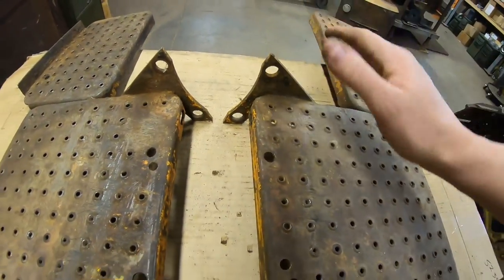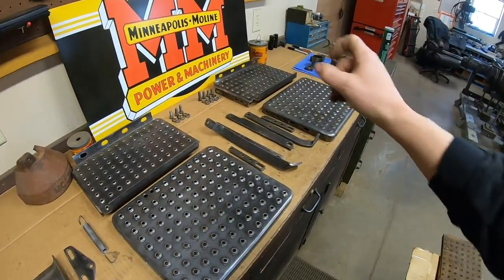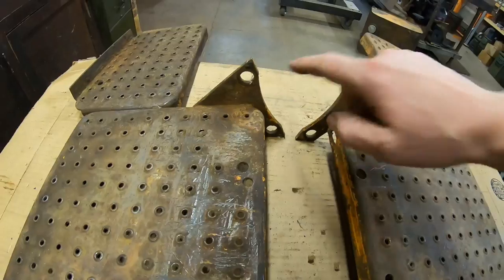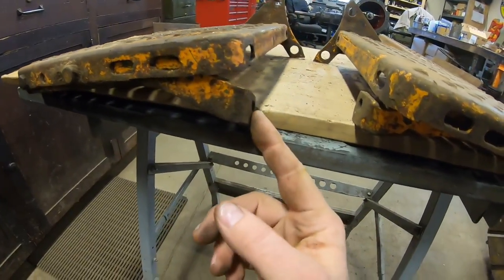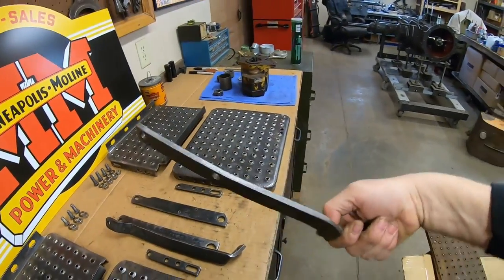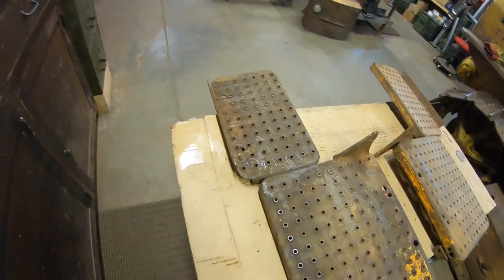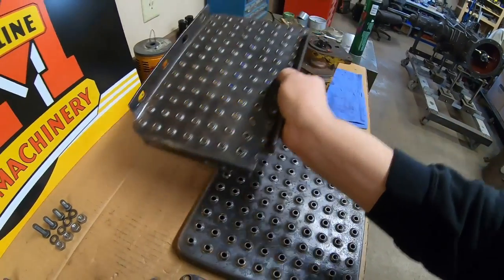Mounting brackets on the production foot plates were also streamlined quite a bit from the rather erector set diagonal brace and spacer plate and everything else arrangement on the prototypes. The two back corners just used that piece and that piece that went under four of the transmission case flange bolts. And then we had this straight across bracket at the front with the tight angle bend short drop on both sides that mimics what just the right side front bracket was on the prototype. The final difference with the productions is that they offset this rear plate quite a bit, whereas the prototype ones were pretty much in a line with each other down the outer edge.